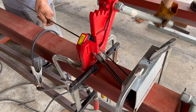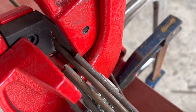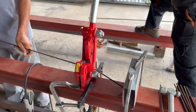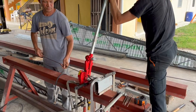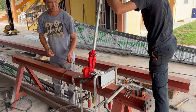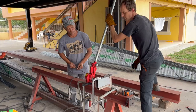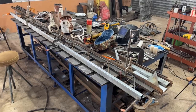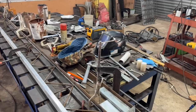The bending method from the previous clip was dropped because it took much longer to assemble the bar joists — the W's were a wrestle to get in place and always wanted to move around. We found that shearing them with a manual bar shear worked pretty quickly. We were able to do the several thousand bars we needed pretty fast, and what's nice is you don't make all the dust, noise, and sparks that come from other cutting methods.